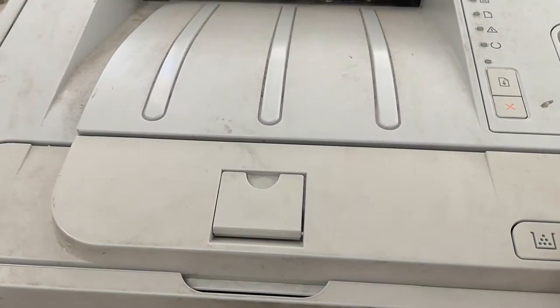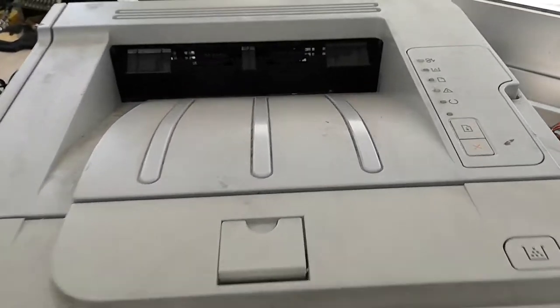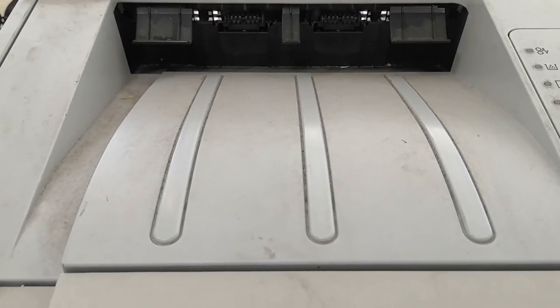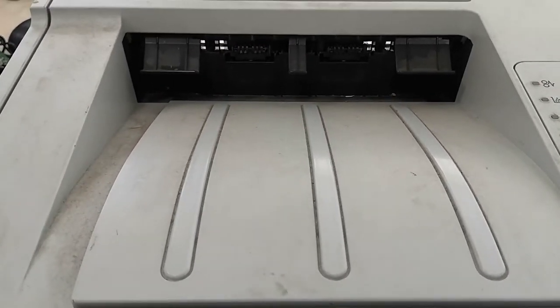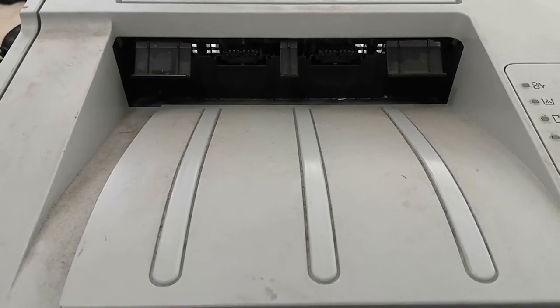The device is giving a paper jam error because the test output button is pressed and there is no paper pickup. When I close and open the cover of our device, it tries to print again, thinking that we have cleared the jam.